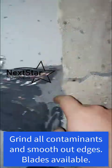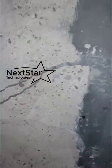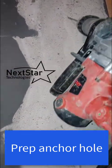The reason you have to put carbon fiber on is because the epoxy will bond the wall back together, but it does not prevent the load. The carbon fiber distributes the load so the epoxy does not fail in the future.